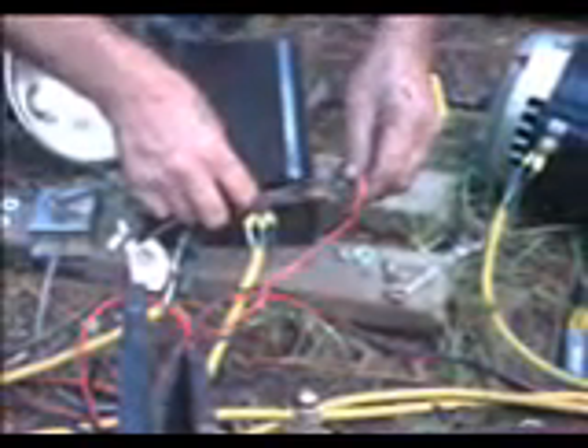We're going to be hooking our positive up to here. Now, we're not going to just hook this up — we're going to charge it slowly with this light bulb. We'll see if the light gets bright and then dims. At this point the capacitors are charged up, so it won't do it — but it seems it will do it now.